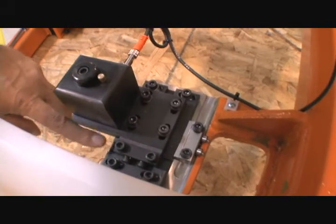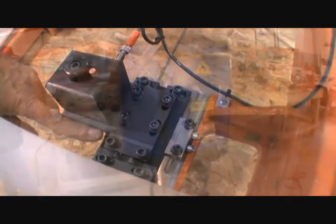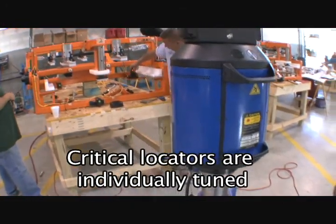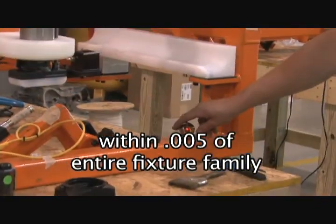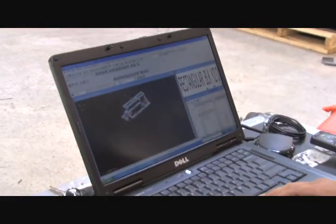The molded tanks are located on three tunable locators. All the fixtures were CMM calibrated and the locators tuned so that every critical locator on each fixture is within plus or minus five thou of each other from fixture to fixture.